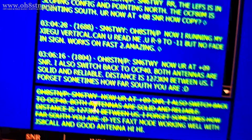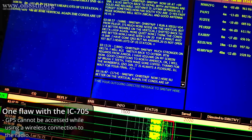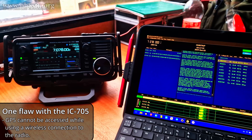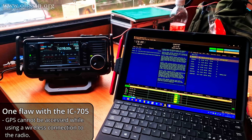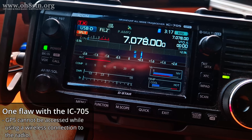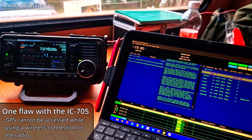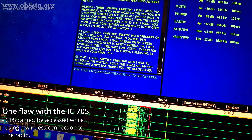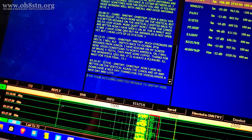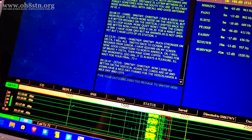It was a good test with Jan, so I think we can go ahead and finalize the QSO with him and move on to the next topic. While we wait for Jan's final to come in, let's talk a little bit about the GPS on the ICOM IC-705. JS8 Call and FT8 both require a clock sync or an accurate clock on your computer to be effective. One of you asked in a comment why I wasn't using the wireless connection for the IC-705. The problem is the GPS is not accessible as a virtual comm port over a wireless connection. Over a wireless connection I can get the audio interface and CAT control, but no GPS. I think this is a massive error from ICOM and one which should be corrected in a future firmware update. That's why I'm not using the wireless connection.